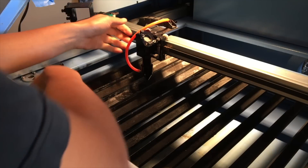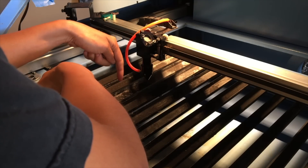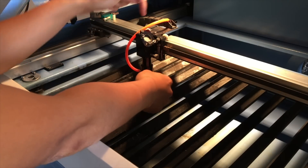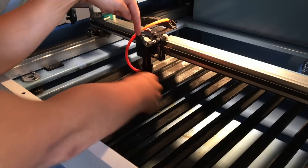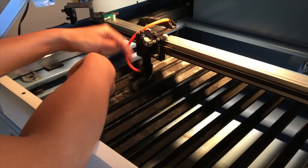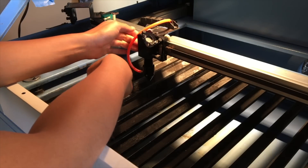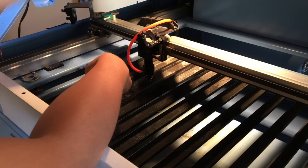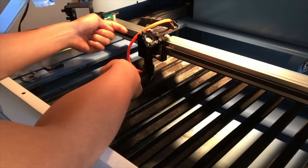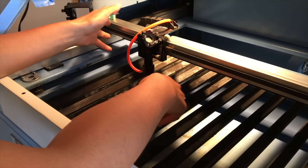The thing that I've been wrestling with the past few days is getting the laser beam aligned. The overall goal for alignment is to make sure that the beam travels vertically through the center of the lens that lives right here, and that it does so regardless of where the cutting head is throughout the workspace. That means the beam coming from the back, going up here, and then traveling this way, needs to be aligned in parallel with the mechanical axes.